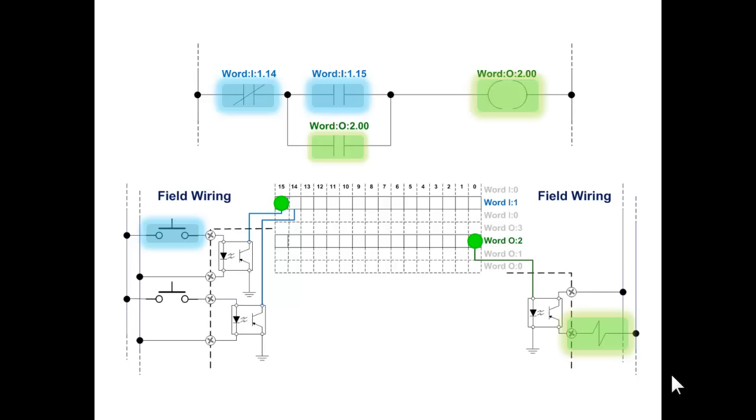But you say, wait a minute, it's already on. That doesn't matter. The PLC is not that smart. It doesn't know the bit's already on. It just turns it on every single program scan. So every single program scan that this rung is true, it turns on that bit in memory. Now it was already on, so it's redundant.